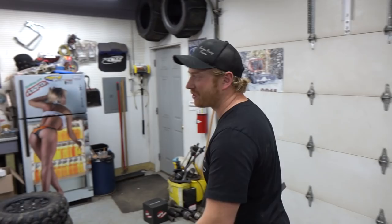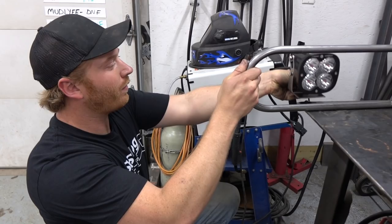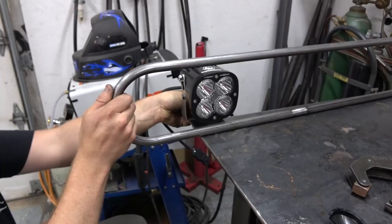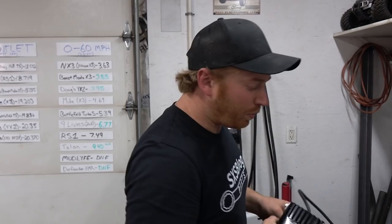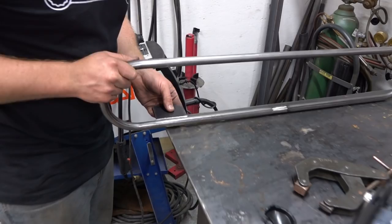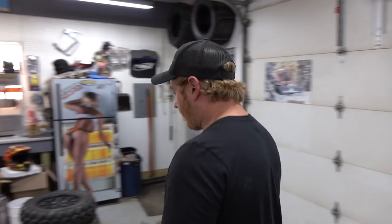We're going to take this flat stock we just picked up and weld some tabs — about two and a half inches long in six places to give us a flat surface — then bolt the lights to them. We'll also add a hoop support in the middle. Six of these beefy lights on this bar is going to be a lot of mass, and the support is out at the ends. So we'll put at least one vertical, maybe a vertical between each light to tie the two halves of the hoop together for strength.